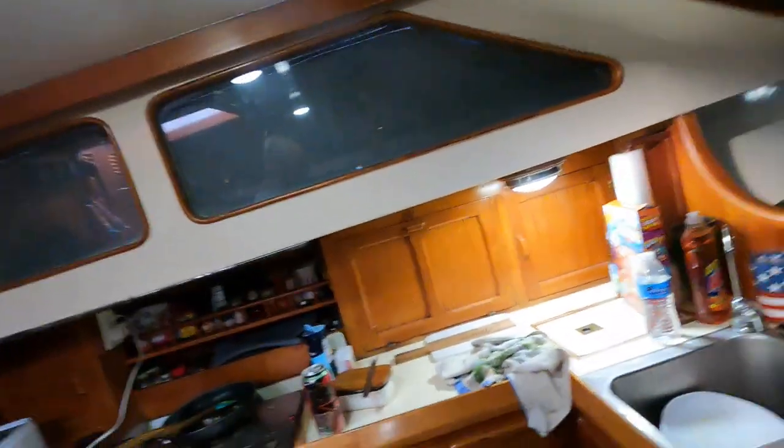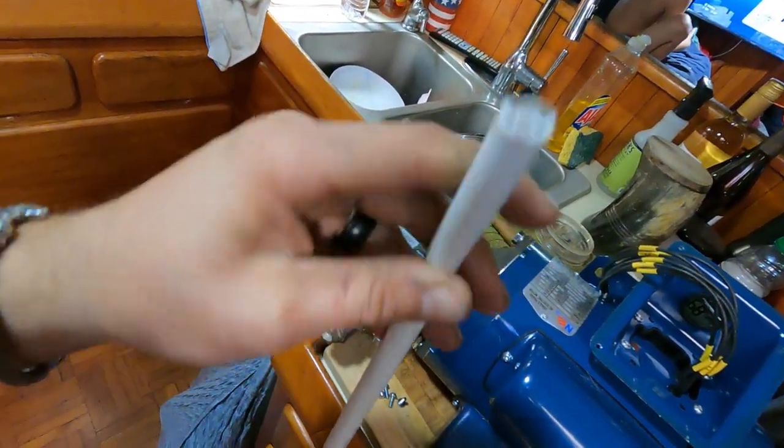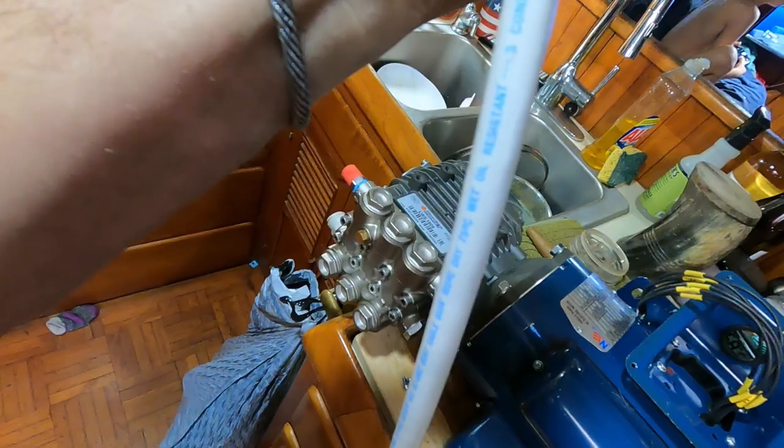I don't care to use solid core stuff. I'll use a multi-strand. This stuff's definitely a little more expensive, but I'll use this multi-strand. This is 10 gauge multi-strand, and this is waterproof, oil resistant. Basically, they're copper multi-strands, and they're usually tin coated, so that helps with corrosion. This is what I use for any wiring I do, because there's moisture everywhere and that's what's going to get in and eat stuff.